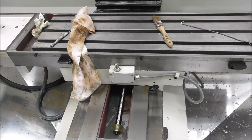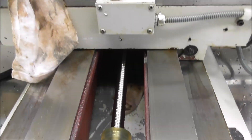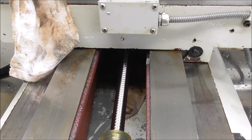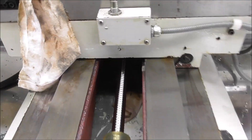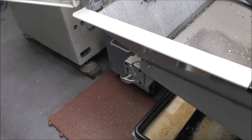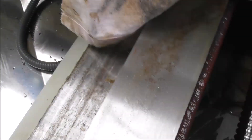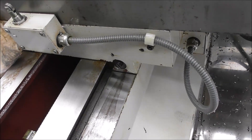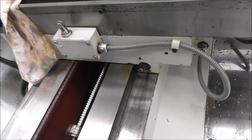The main job today is to check the Y-axis is straight and not buckled with my new level. I've flushed down the ball screw with kerosene, traversed it backwards and forwards several times, then started adding slideway oil onto the ball screw and ran the slideways backwards and forwards cleaning them while pumping oil through. I'm pleased to see new oil coming through and the slideways are wet with oil, so the one-shot oil system is getting through quite well still on this machine — really good news.